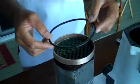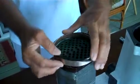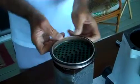And you can see that by the fact that I machined this down, the O-ring doesn't snug up on the flange anymore. So what I did was I went to the next size down O-ring with a larger diameter. And this is a 4 7/8 inch O-ring with a 5 3/8 OD and a 1/4 inch width. So this is going to be the O-ring that I'll be using, which will be the same outside diameter as the original, but a little bit snugger and a little bit thicker.